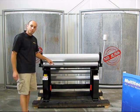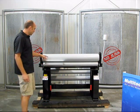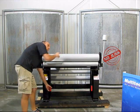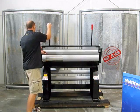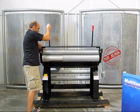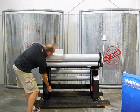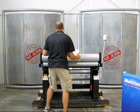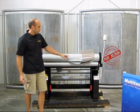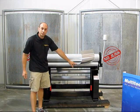I've got a piece of 50 thousandths aluminum. Slide this through our rollers — I have my heights adjusted, grab my handle, and my counter weight will help me. We'll wrap the material up and around. And just like that, we've created a nice large radius in our material.